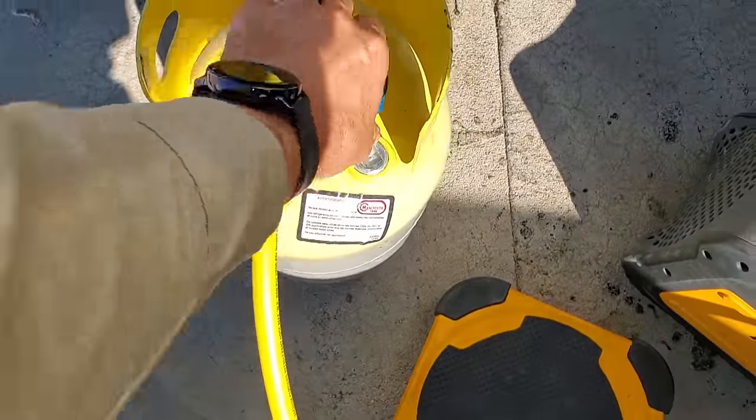What I ended up putting in there was a Sporlan catch-all dryer, and I have a breakaway of a catch-all, and you can see what it's comprised of, the desiccant material right here. So the refrigerant's going to flow through the desiccant, then run through a media strainer, then out of the dryer. I've heard horror stories about this stuff breaking up and getting through the system. I've personally never seen it, but I've just heard horror stories.